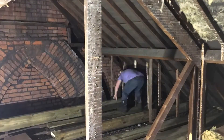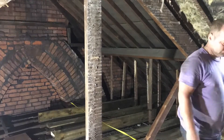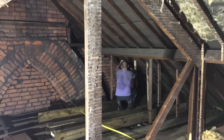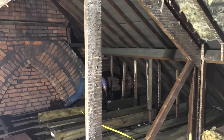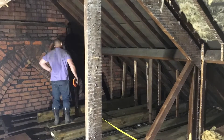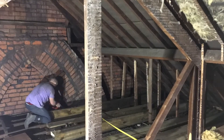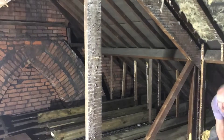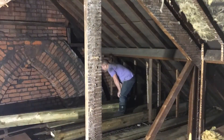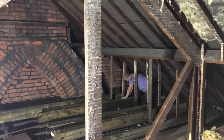On this first section of floor — we have each end and then the middle — I'm just getting the beams up, checking the spacing, making sure I can get them in at 400 centres, which is what the structural calcs require. I'm making and placing packers on the wall plates where the roof meets the wall. This first section of eight beams I did on my own.